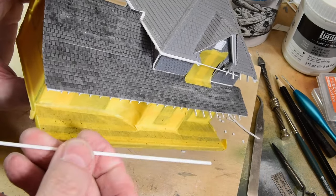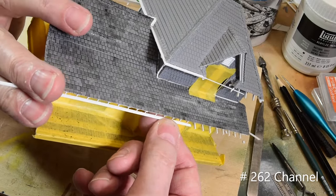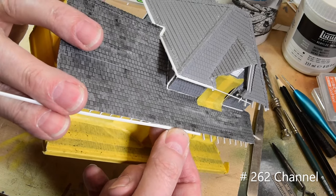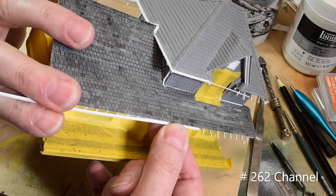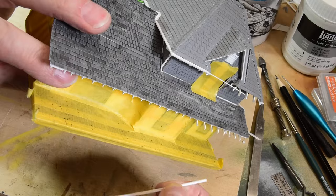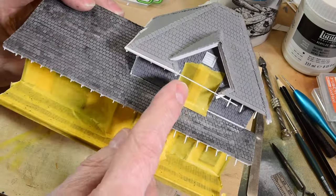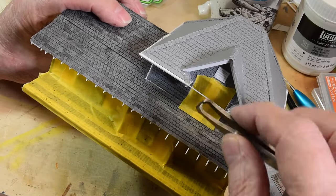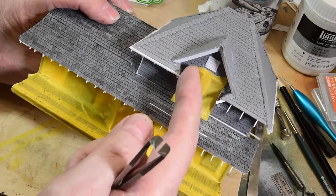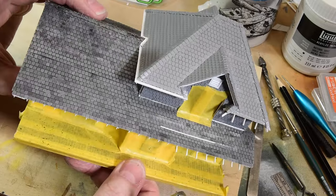So you can see now I'll mount this eave and it'll sit just under the lip of the shingles so the water runs off into them. That's the advantage of doing shingles like this. They look cool when they're done. And you can just see the trim there. This is the 10 by 20, so this will get nipped off and then I'll put a trim on that return eave trough and then I got to do these two up here and then all the eaves are done.